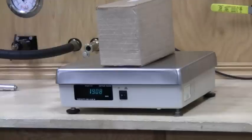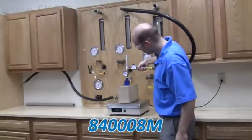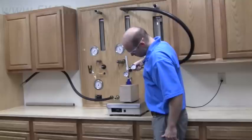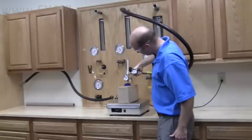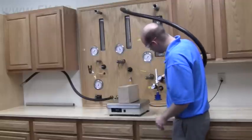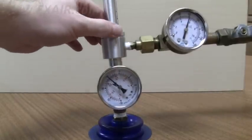Let's say we want to lift this 19 pound cardboard box. Here we have an 84008M. At 80 psi of inlet pressure, this unit will consume 8 SCFM of compressed air when generating 15 inches of mercury. With a 2 inch wide vacuum cup seen here, we can lift 11.6 pounds — not enough to lift this 19 pound box.